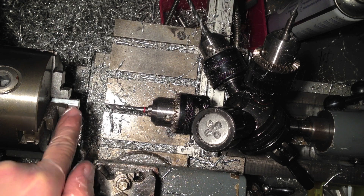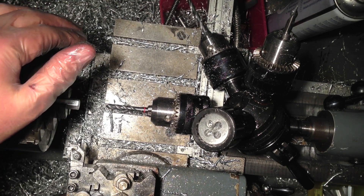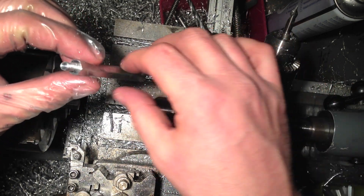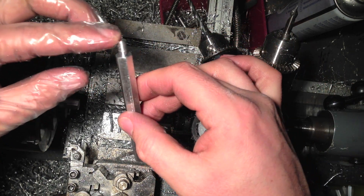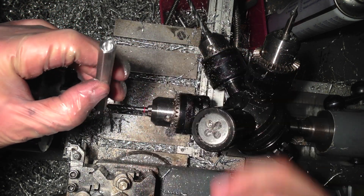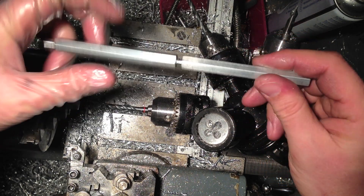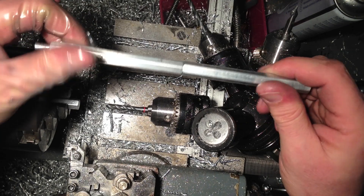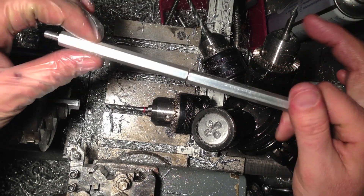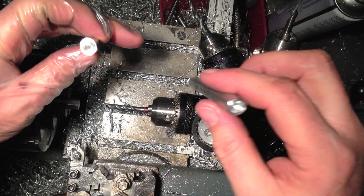I've got 1,000 of these bad boys to make, 3,200 of these bad boys to make, and 3,200 of these. Now this is a fully completed part — we've got the 10mm M6 thread on that end, M6 on this end which has been drilled and tapped, so at least 10mm of it is threaded. These go together sweet as a nut — the thread formed inside these aluminium parts is very good.